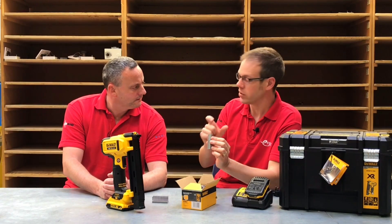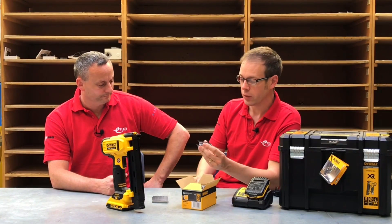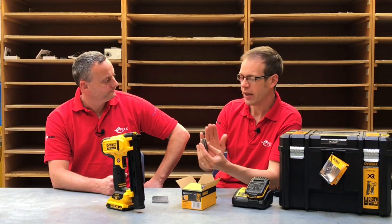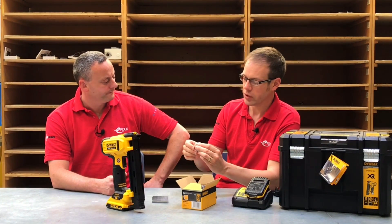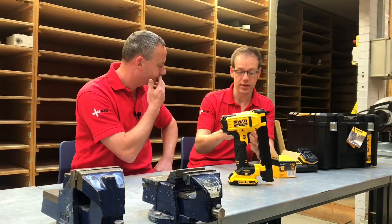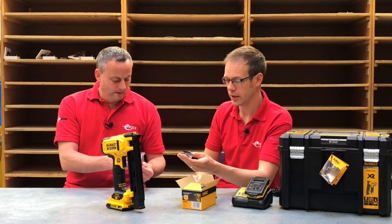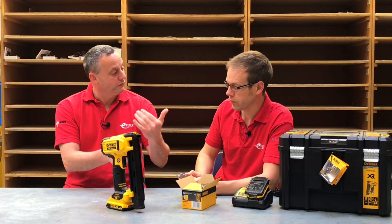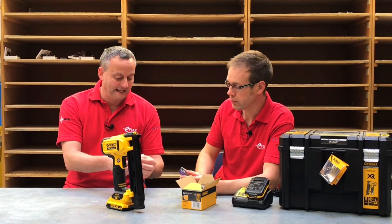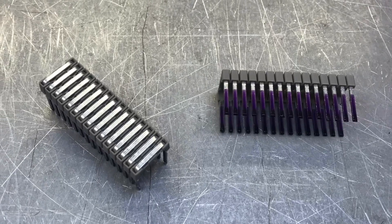There is a one-size-fits-all policy — we believe it's the only staple size that will fit in here, and whatever cable you're using, this will tack onto it. We'll look later at how firmly it tacks on and how secure it is. It's a standard size: 25mm deep, 19mm wide, and 15 to a clip. They've got a plastic section on top to stop the metal clip from crushing against the PVC, which is a nice feature, and they are metallic.